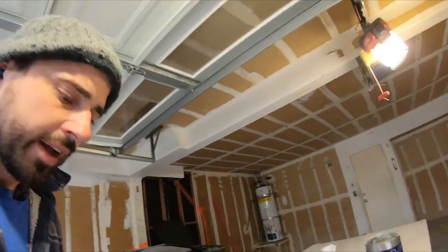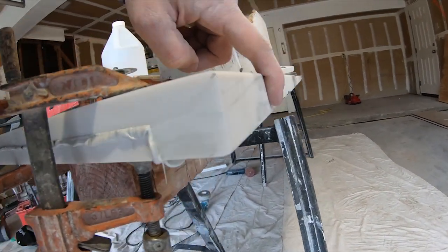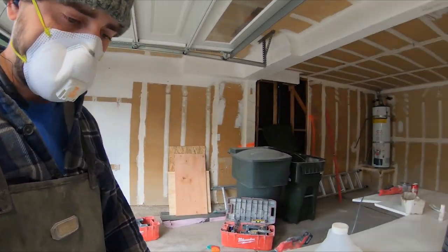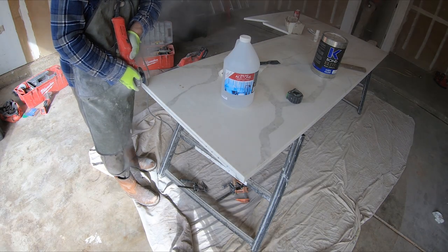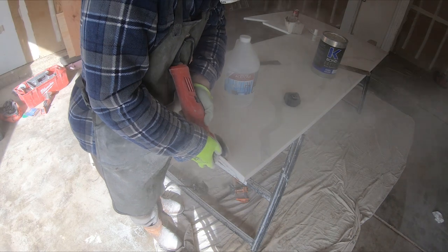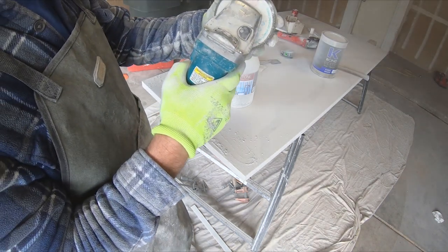You've got to make sure that you give it sufficient time to dry. If you go too early, it'll start tearing out some of the epoxy and then you'll have a really bad look. Now to make sure your bullnose is flat, what I usually do is cut off about a quarter inch — I've marked it about a quarter inch in and I'm just gonna cut that off. Instead of trying to polish all of that off, a lot of times the stone is not totally flush, and this makes it quicker and more perfect. It also saves a lot of sandpaper, and the blades last a lot longer.